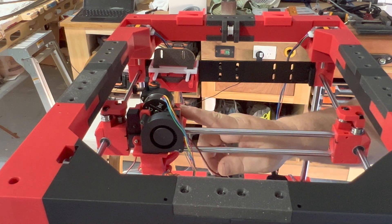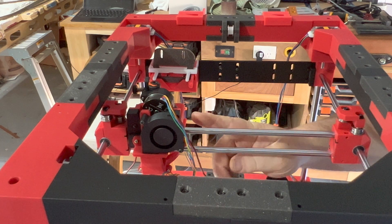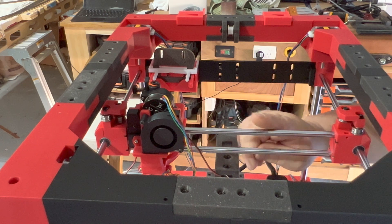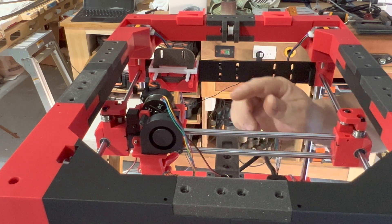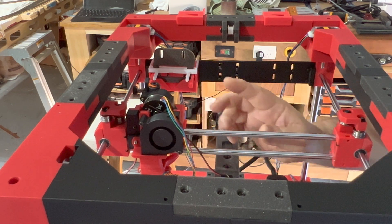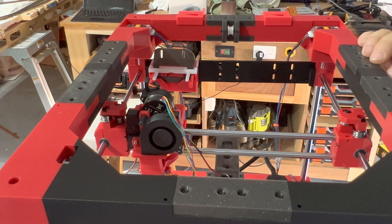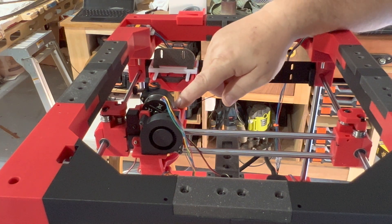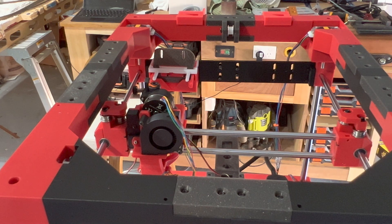The design of the actual hotend is exactly the same as the standard Rook except I've extended it by 4mm to put the magnets in. I've obviously reversed it so that it's now pointing backwards. I've reduced the fan by 4mm so it's actually still the same overall depth. There's been quite a few changes to the actual front to allow for these grabbers and poles and so forth.